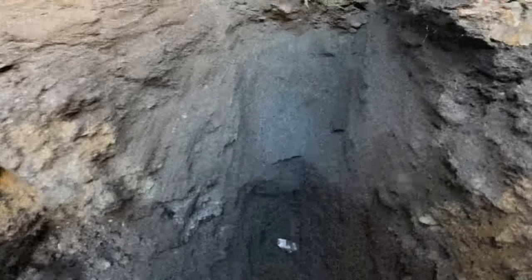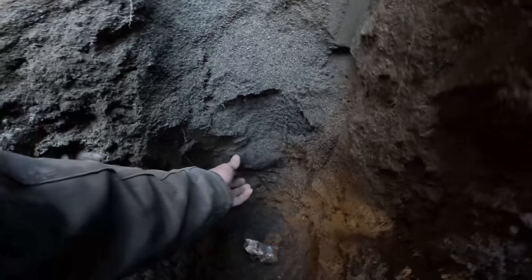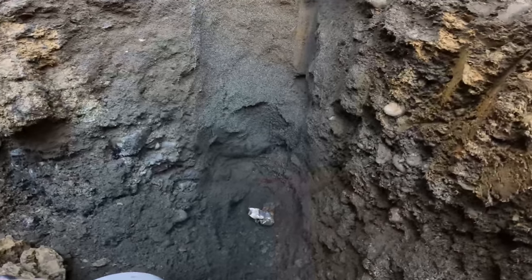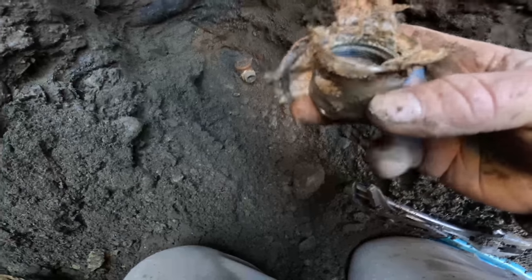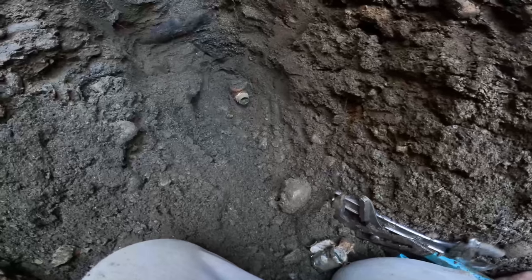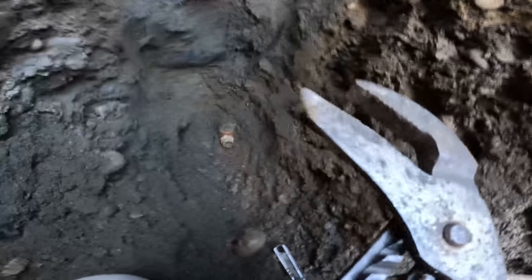We're down to the curb box here — here's our sand layer. Look how close — this is our two-inch, maybe three-inch gas line. That's why this was angled up out, they got away from it. They always put duct tape on here. I already unscrewed that — it's full of dirt. I've got to clean these parts out and make sure that rubber gasket is in there. Don't put this on if it doesn't have a rubber gasket. Get a new one from your town or wherever. Always put the gasket writing-side out.